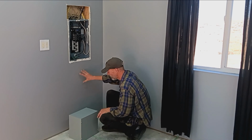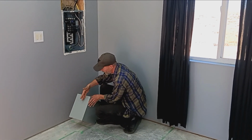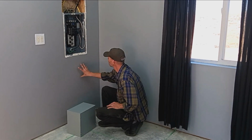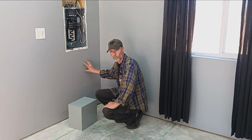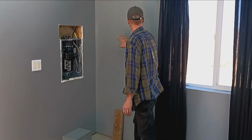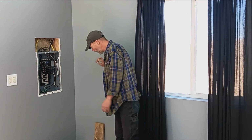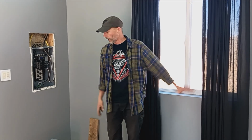So once the box is in the wall, it's going to sit in there, and about 2/3 will be sticking out, or 1/3, enough to run some conduit. So conduit will be run outside of this wall, up here, and then my panels will be installed up here. The phase converter itself panel, and then the 3-phase load center, which will allow us to run conduit to the milling machine and to the lathe.